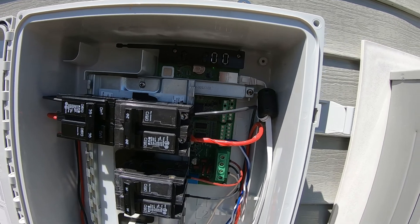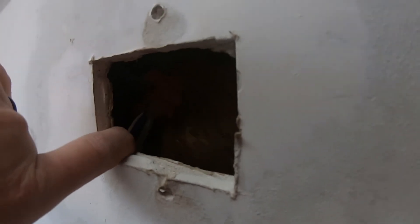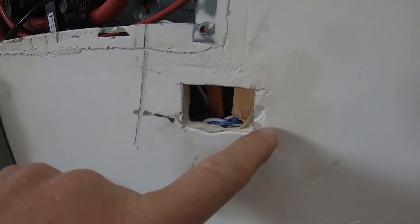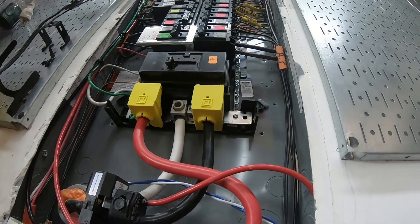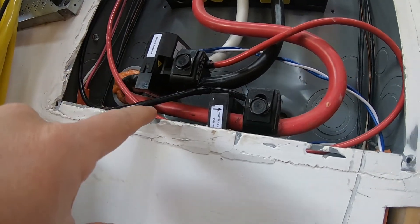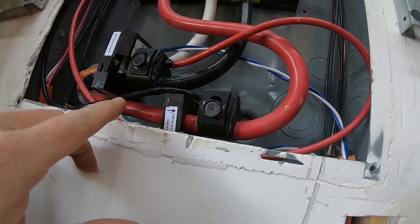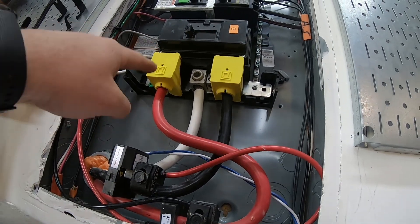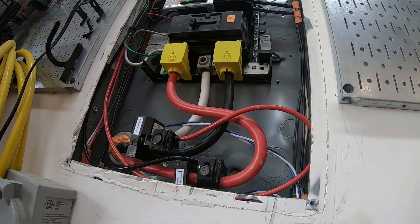The main thing I wanted to go over is this part here - it's flashing right now because it just got power back and is booting up. On the back side, I've got the two wires coming in for the consumption meters. They come through a 2x4 where I cut a little hole to access through, then come up the bottom. They connect with the arrow facing the direction toward the load - our panel system - that's how it measures. It needs to be on the downside of your incoming solar. The reason these connect red-to-black and black-to-red is that the black is normally line one, but when this house was set up they put line one as red, so the installers kept black as line one as most systems normally are - that's why the swap is on here.